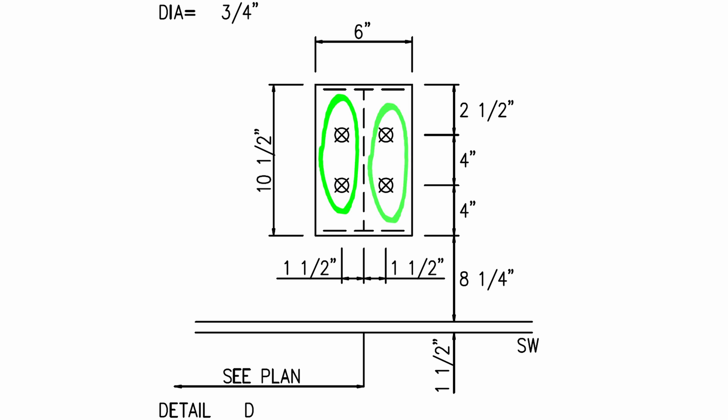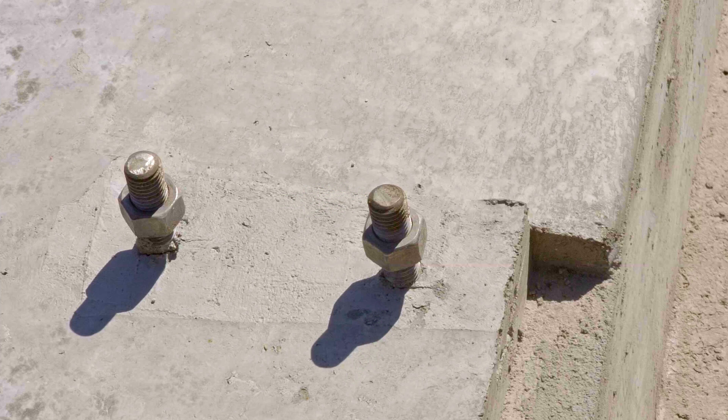On the main frame column anchor bolts, we have three-quarter inch bolts here — they're almost always three-quarters of an inch, though on bigger buildings they could be an inch. Those bolts are on both sides of the column web, three inches apart, but we show them on the plans as one and a half inches from the center of the web. So one and a half plus one and a half is three inches. 20 foot minus one and a half inches is 19 foot 10 and a half inches, and 20 foot plus one and a half inches is 20 foot one and a half inches. I've accidentally measured to a bolt at 20 foot that was misplaced — I just saw 20 foot and didn't notice it was actually an inch and a half out of whack. Keep in mind we're measuring to the center of the bolt, not the edge. Once bolt placement is verified, we can check the elevation of each of the column pads, and if those check out it's time to start hanging steel.